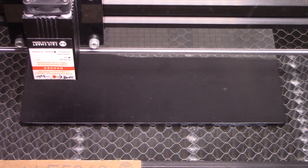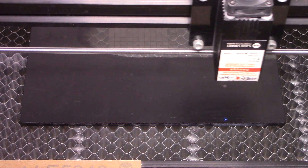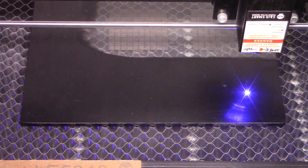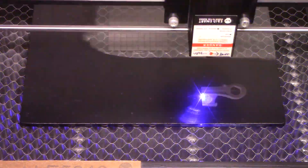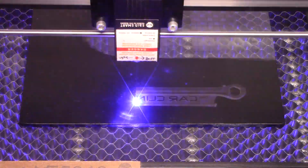I still have room on the power setting test that I did to do this burn. So I will first run my frame option to make sure that I've got a good working area. The laser is already focused for this material, so it should be good. As we saw in LightBurn, I am burning this image backwards so that being on top of the glass, when I turn it over it will be forwards and the etching will be right close to the paper.